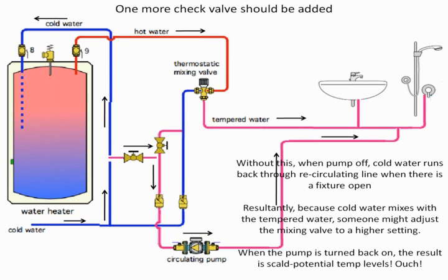You mean if we used a solar water heater? Yes. If the solar water heater is strictly for heating the water for domestic use, there's no change as far as code requirements go. If it's also used for space heating use, a thermostatic mixing valve then becomes required, and there's a limited temperature that can come out.